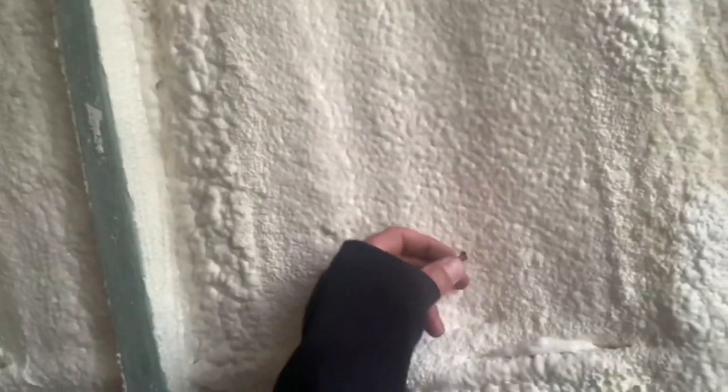Thickness looks good. It goes all the way up to the wires that run through there. If we check the thickness on the walls, the screw head almost goes all the way into the foam. So it turned out pretty good. We got about 2 inches worth of coverage in there. Here's some more spots, examples of where the stuff did not cure all the way. And I will check that tomorrow.